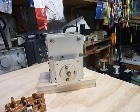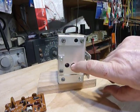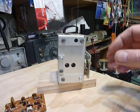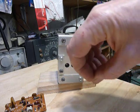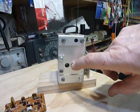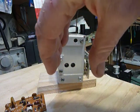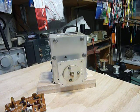When calibrating your dial, remember that when you tighten up those trimmer capacitors you're increasing the capacity in parallel with the variable capacitor — that spreads your dial points out. When you unscrew those capacitors you reduce capacity in parallel, and that compresses your dial. That's how you calibrate the dial, and it's all in the operation manual for the HW-104, which is listed on the internet.